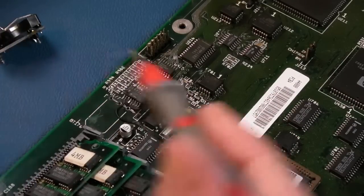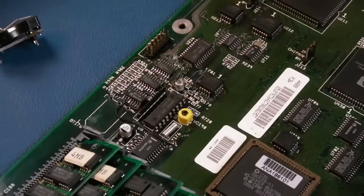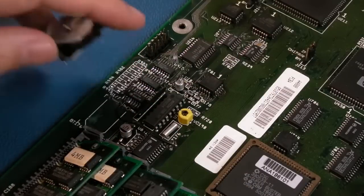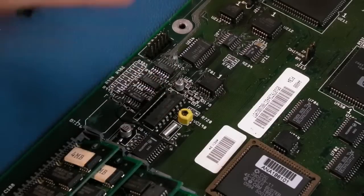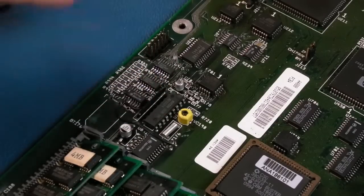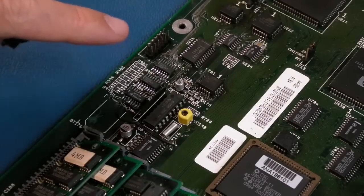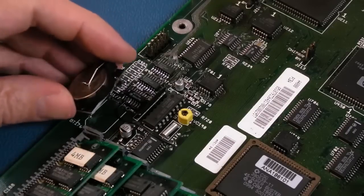And it's driven me to despair. All I did is put a screwdriver in that pot, I twist it, measure the voltage again. And it's normal, I'll show you. What I was figuring is that maybe it wasn't oscillating, so instead of it doing some sort of efficiency thing where it's getting oscillation, it was stuck in a really high drain state where it's just not doing anything. And I think that's what it was.